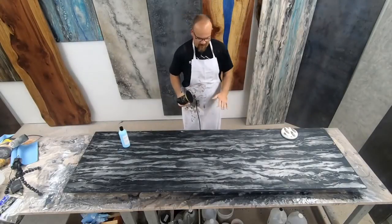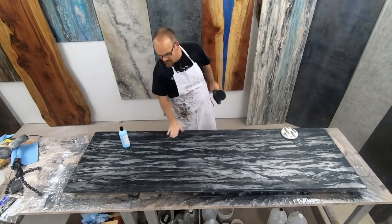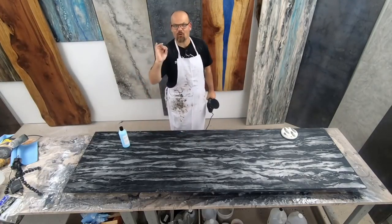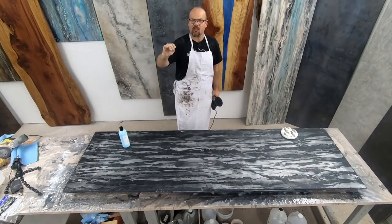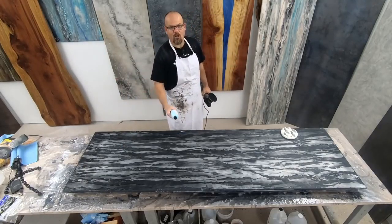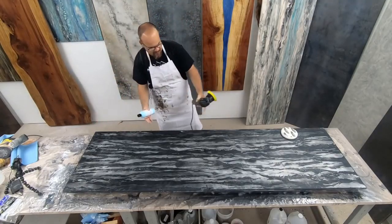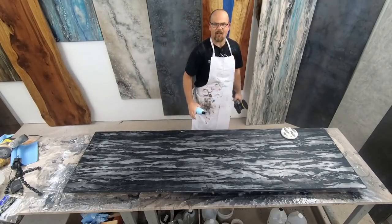We're all sanded up and it feels really, really good. This would be a great place to stop if you wanted a matte finish — you could just use a cleaner, clean it off, and you'd have a great matte finish. Or you could stop at whatever step you'd like, depending on how low a sheen you'd like to achieve. At this point we're going to use our polishing compound and polish this out. We start in two-foot sections — about two feet at a time until I get the polish I desire, then I'll work right down the piece.